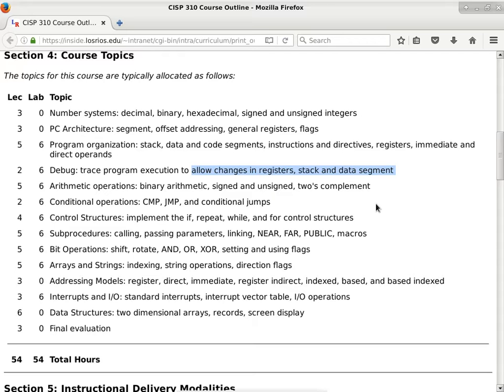So when you look at just the addressing modes topic, we have done register. Every single time an instruction changes a register, it is using what we call the register addressing mode. Done. We are done with immediate as well, because every time you use the LDI instruction or A, B, C, or D equals star PC++, that's immediate. Whatever is next to the opcode specifies the actual bit pattern that you use to update a register. That is immediate. We also talked about register indirect, which is this one here. Every time you see the asterisk symbol, asterisk B, asterisk C, and so on, that is indirect.